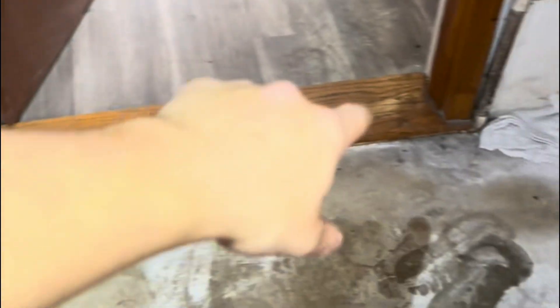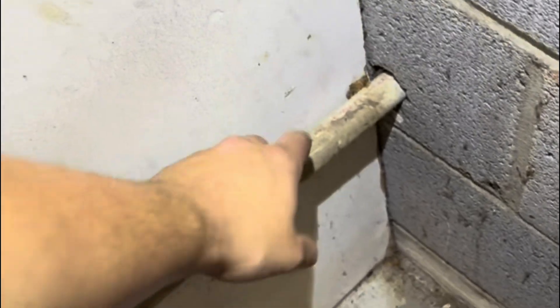So what I'm going to do to fix it properly, instead of just replacing this section of clogged PVC, I'm going to fix it permanently for them. I'm going to cut it here, install a barb fitting adapter, pump tubing all the way up and over, and install a condensate pump right there. That way the drain goes down into the condensate pump and it pumps it all the way up and out — goes out no problem. Won't be in the way of their door, and their drainage issue will be fixed, and that will not clog up again.